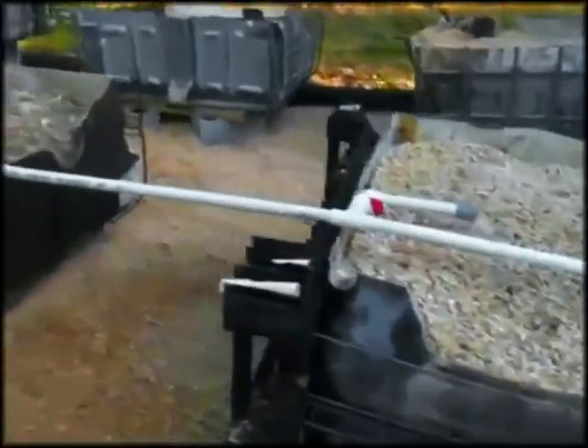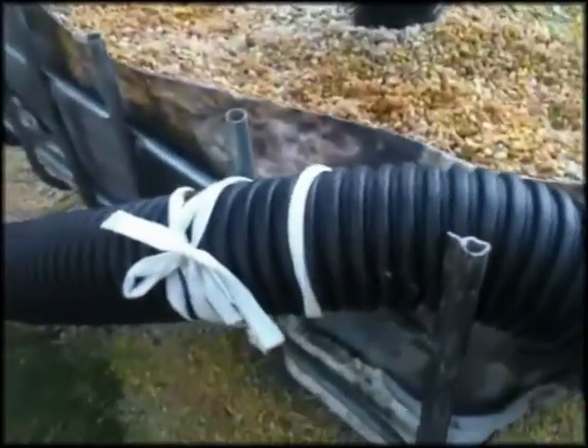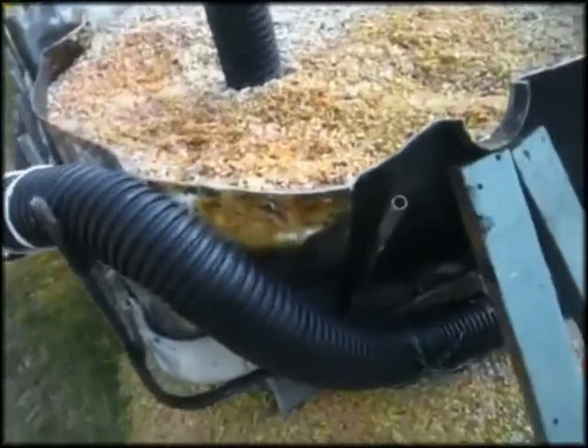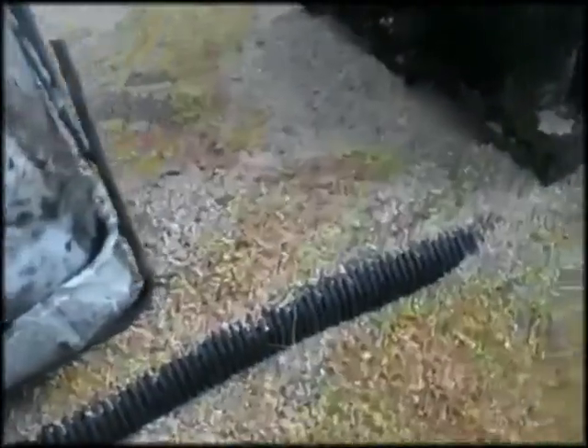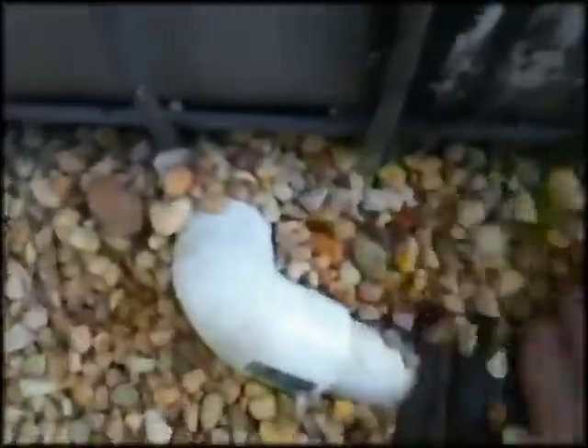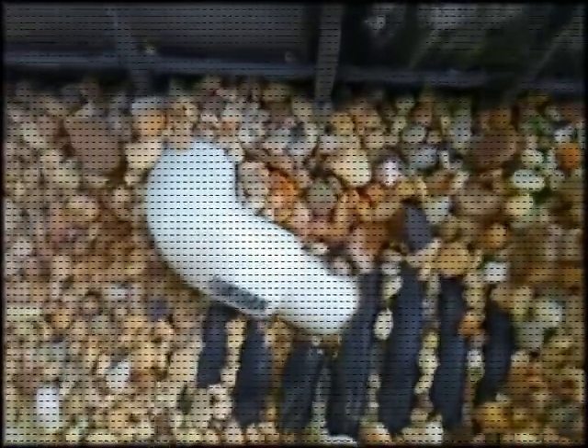As far as the drainage is concerned, I got a 100-foot 4-inch drain pipe — the one without the holes in it, obviously — and I had that wrapping around the entire unit. Right here I have it tied to the top of the unit so that water wouldn't go up. I wanted it to have a downward flow, a downward slope. I partially buried it here. As you can see, we've got the bottom part of the bell siphon cut into it. I'm trying to make it as close to a good seal as possible. The good news is that it doesn't utilize all four inches, even when all three beds are draining at the same time.